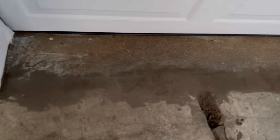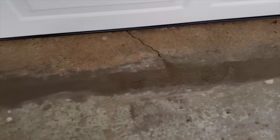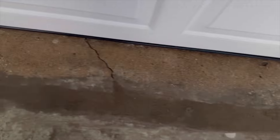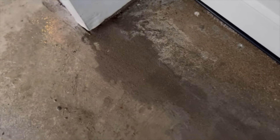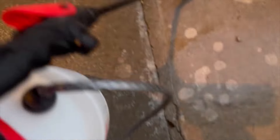It's set for about an hour and we just soaked it down again. It's not perfect and not super even — there are spots in it, but I really don't care. I took a wet sponge and ran it across the top just to smooth it out a little bit, and I think it's going to turn out nice. That's a lot better than a huge crack in the sidewalk, so I'll take it. I do have other spots around the house to do — you can see this old patchwork just isn't very good, it's cracking up. So I'm going to knock all that out, and as long as this dry pour deal works, that's how I'm going to repair the rest of this concrete.